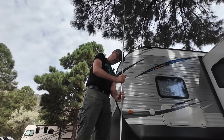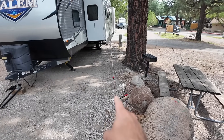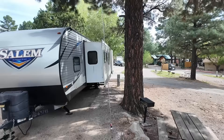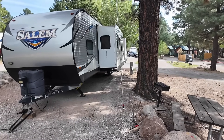Let's get it fully extended. Check for overhead power lines. So there is the ground spike, the blank adapter, the radial plate, the coil, and the 25-foot whip — which goes up into that tree and rests on one of the branches. And then my RV with metal siding is right next to it. Everything affects everything. I'm in a compromised space here — about 40 feet of RV slot, a big tree, and metal siding. We'll take that into account when we do our SWR measurements.